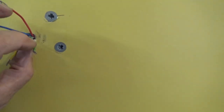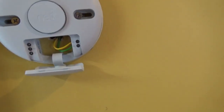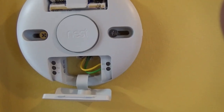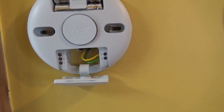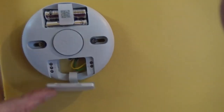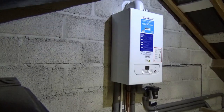I'm getting rid of those two wires right out from the wiring centre so there's no chance of any high voltage coming in anywhere. I'm going to make sure this spare wire now goes back with the other so I'll have two cables only going back to the boiler. Terminals are made - I've completely pulled out the neutral and the live right back to the wiring centre. I've now got my OT1 and OT2 - the green and the yellow - hooked in. They're a bit awkward to get in at 90 degrees, so do it before you screw to the wall, then put the thing on the wall.